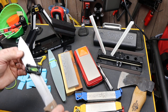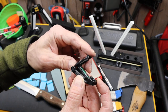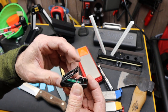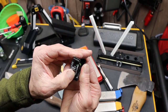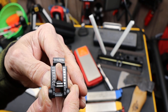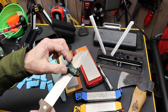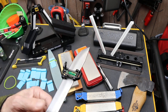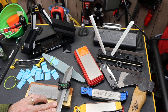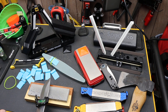There's another one here — this is called the Hold Bubble sharpening angle guide. This little guy is a magnetic plate with a level inside, and it folds up very small. You align the level with the degree that you want — you've got quite a range, up to really steep angles for chisels. So if I line it at 15 degrees and put it on the flat of a blade, I've got this level right here. If I tilt it to center the bubble, I am now holding the blade at 15 degrees.